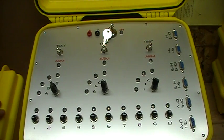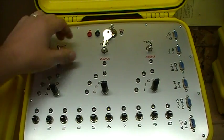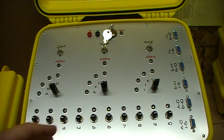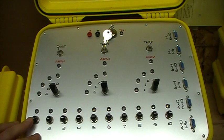Another feature I like is the continuity testing. When you've got your show set up in the field and you're ready to go, you want to make sure every cue is hooked up properly and you don't have a bad e-match or igniter. Continuity testing sends a very small signal out to your cue — if you've got continuity it loops back and gives you a light. If you have a bad e-match or igniter it won't give you a light, so you can send somebody out to check that specific cue, re-hook it, or swap the match before the show.